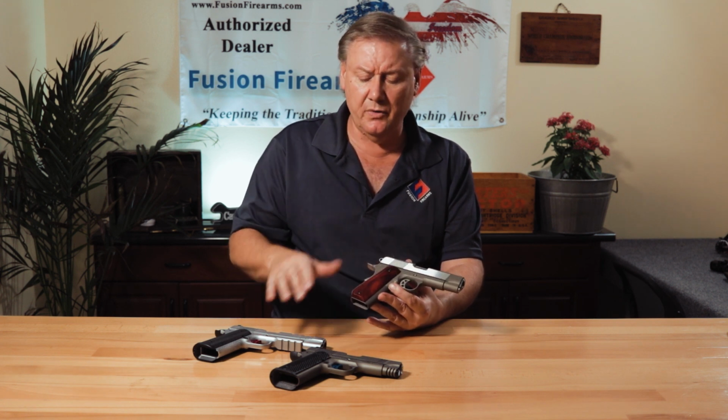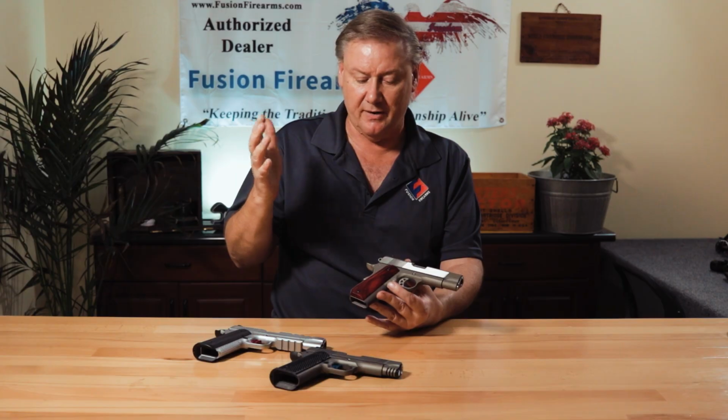Also, with the chrome product, the HD chrome product, you've got a really hard shell on there. You know, 70-72 Rockwell is extremely hard. That is harder than most tools and harder than most even fixtures and jigs that we make for the machine shop.